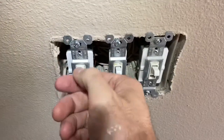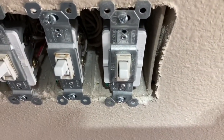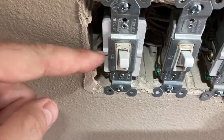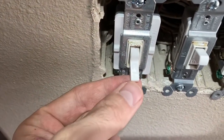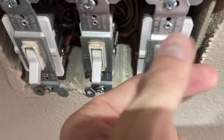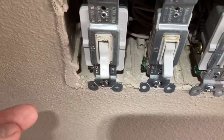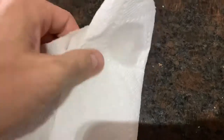Comparing the light switches — the ones to the right are fine, but the one on the left is actually cockeyed, bending in, and that's obviously a problem. My guess is I'm going to have to fix or replace the actual light switch. In your case, it might just be a matter of grime and dirt buildup, so with the power off, you could use a general degreasing spray very lightly.